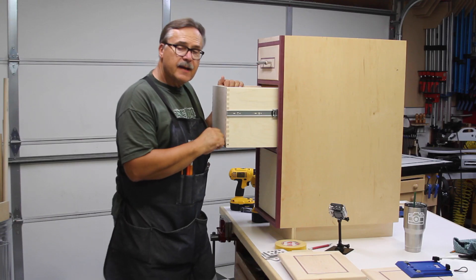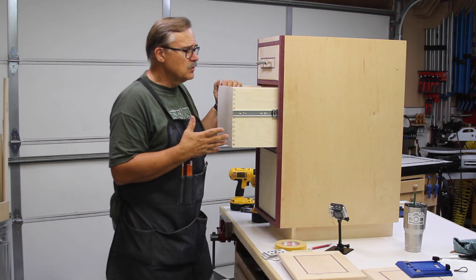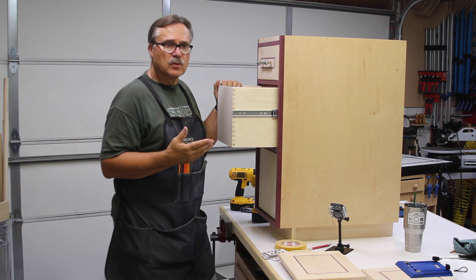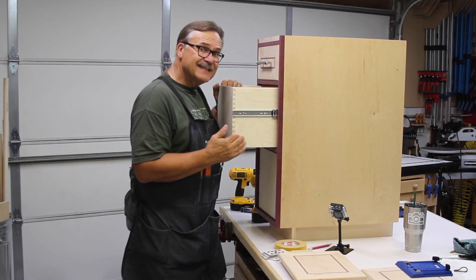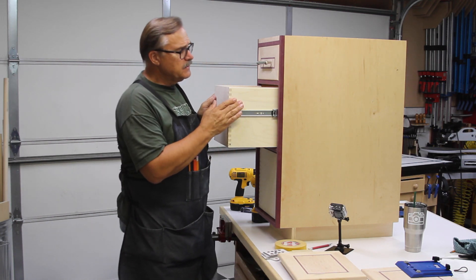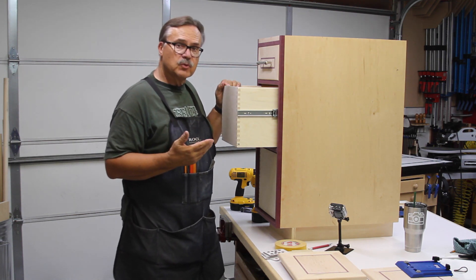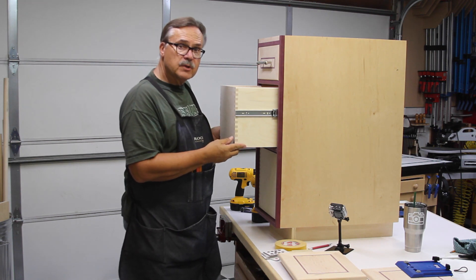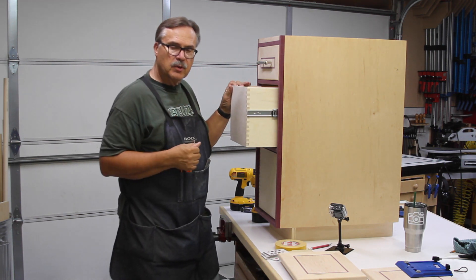When building cabinets you want to use drawer material that's going to be a stable wood. You don't necessarily want to make it out of just regular hardwood or softwood — you generally want to use something like plywood that remains stable. This particular drawer is built out of Baltic birch. I find that wood to be very good for drawers because I can use the half-inch size to make rather deep drawers, and yet the drawer is nice and solid and I don't have to worry about the load that's going to be put into it.